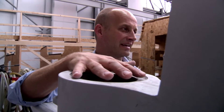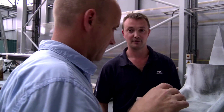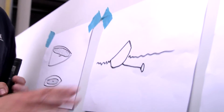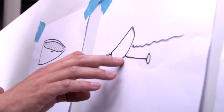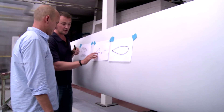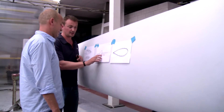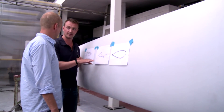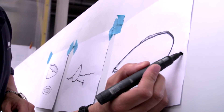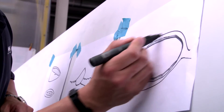James explains the inclined keel pin, which is pretty revolutionary. The canting keel in the Volvo Ocean 65 is actually closer to the horizontal than the vertical — basically a 4.7m wing in the water. By pulling the nose up slightly, water hits the leading edge and more flows underneath, which reduces drag and creates lift, reducing the displacement of the boat. The result? Definitely faster.